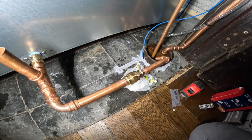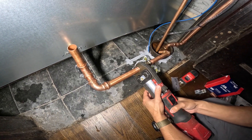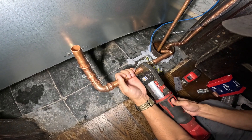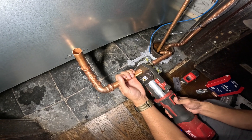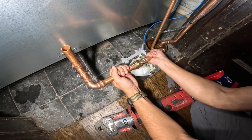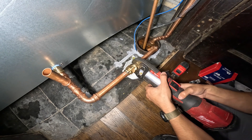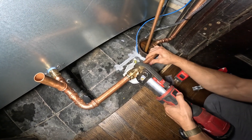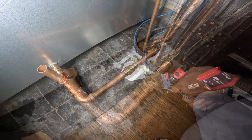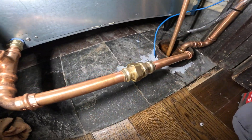Now it's built up — let's press it up. Make sure it's pushed all the way in. Now I'm going to get the tool on there again on the other side. Make sure it's bottomed, make sure it's pitched properly. Hit it. Now we're going to tighten down the union — let's tighten that up, give it a nice bit. That's looking good. Now we've got one more to do.